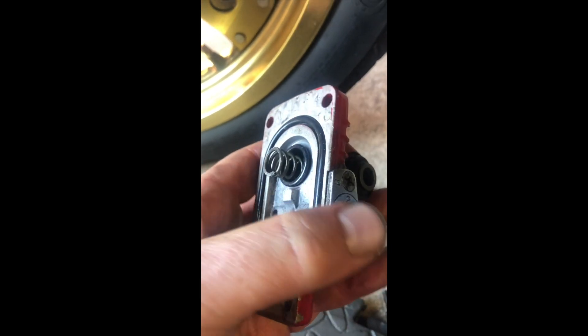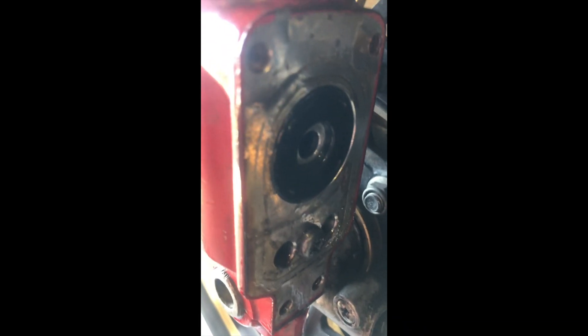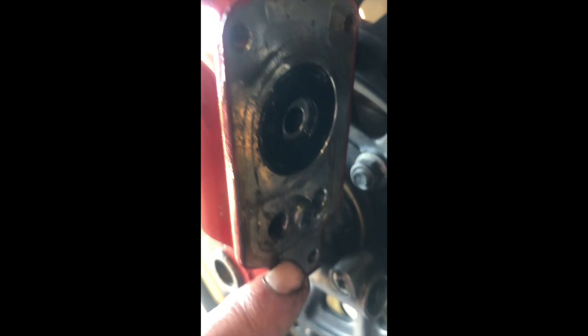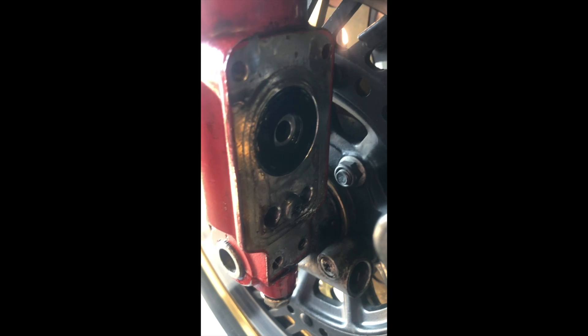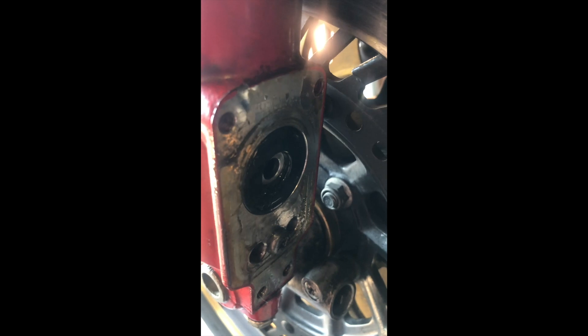You can see that there is a spring and a piston, and on the inside there are basically two holes at the bottom and a hole at the top, and a big seal. This seal only comes into effect when the brake is applied. Normally, oil will flow out of the top and through to these holes here and allow the suspension to operate normally. When the brake is applied and the brake moves in this direction, it pushes a piston and the piston seals against this hole here.